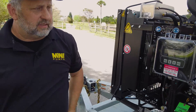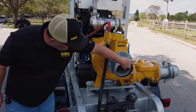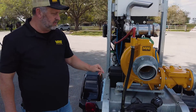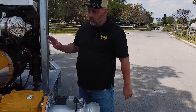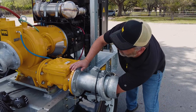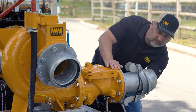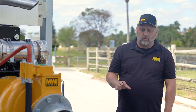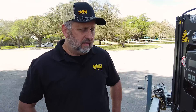Also check the back of the pump — this particular fitting has an O-ring in it; make sure it's there and not damaged. This is on the suction side. On the discharge side, before you connect the hose and without it running, you can put your hand in there and feel the flapper to make sure there are no sticks or twigs preventing it from sealing. When we start up to pull prime, it's essential that check valve seats so we don't suck air through.